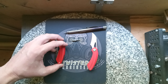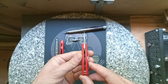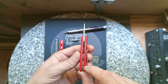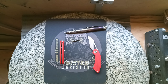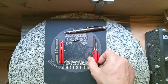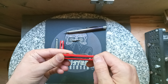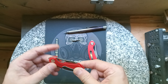One of the other main differences is that with the Liner Lock version you can see there is a backspacer. We have elected to get rid of the backspacer and just have a standoff at the bottom. We also requested that Ostap Hell, the designer, incorporate a lanyard pin, because I believe people should have the option to decide whether or not they have a lanyard when they carry. Having a lanyard just makes it easier to lay your hands on and safer for pulling the knife out of your pocket. Also, having a backspacer means pocket fluff and dust will collect, whereas with our version you can just run a cotton bud through without disassembling the knife.